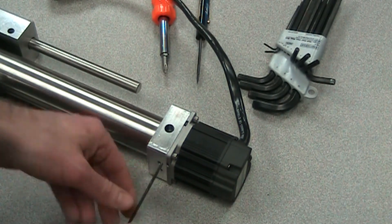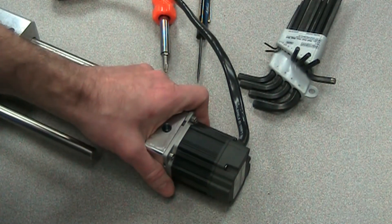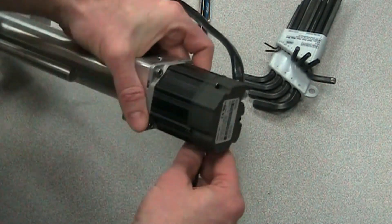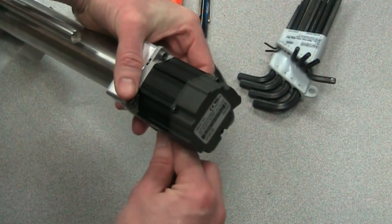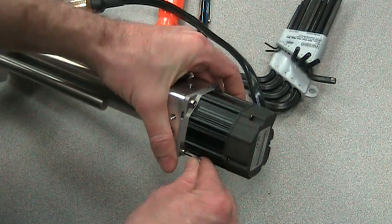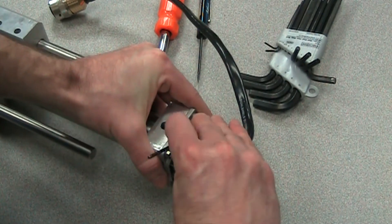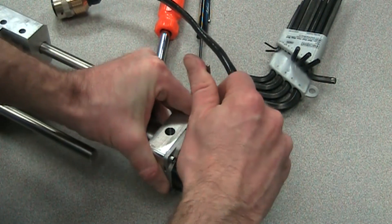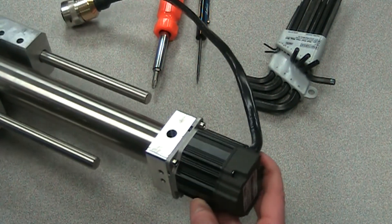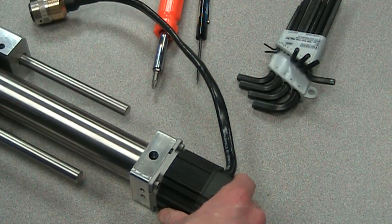If you have a torque wrench, you'd be torquing that to a 19 inch-pound setting. Then we'll want to tighten up the screws again across the rest of the way. The four screws on the motor aren't as important as the collar clamp for torque, because that's where all the work is happening. But it's good to have all these at the same torque so that the motor is properly and equally seated onto that housing. So there you have it — the ERD-15 with the NEMA 23 motor mounted and ready for operation. Thank you.